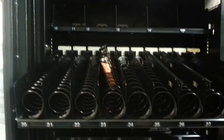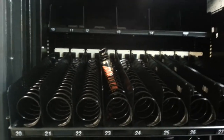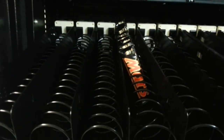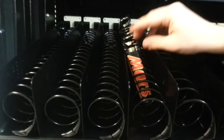To fill the machine with chocolate bars, starting from the back of each coil, place each product in between the coils, ensuring that the bottom of the product touches the bottom of the tray. Generally, the product lays back slightly.